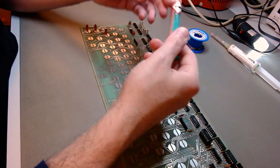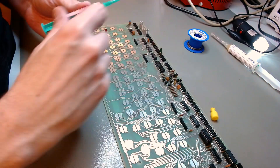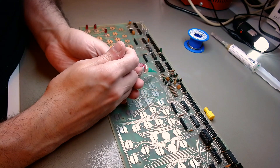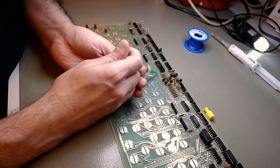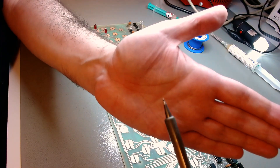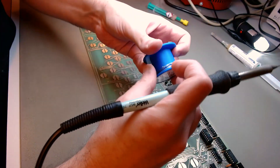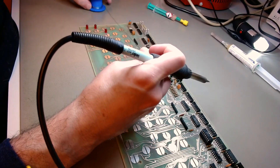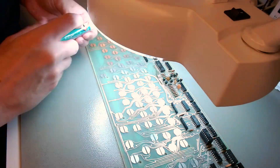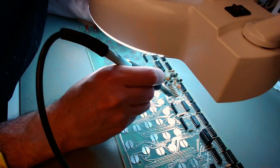I will be using a professional SMD flux — the UFL 22P. It's expensive, it's for SMD rework, but it works very well. I coat the traces I'm going to re-tin with a very liberal layer of flux, because the secret here is to use a lot of good quality flux. I will be using a bevel tip — one millimeter, 45 degrees angle, and a flat surface — so it allows you to transfer heat very well to the traces while maintaining control, because it's only one millimeter wide. I basically retrace the traces with a little bit of new solder on the tip, reloading it as necessary.